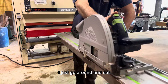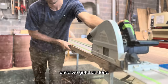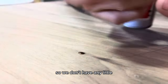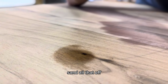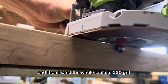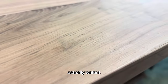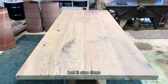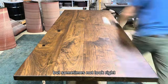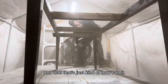Then I just go around and cut square edges onto every side of the table and get it to its final size. Once we get that done, we do a bunch of sanding, start filling all the little holes that I didn't get with CA glue so we don't have any little specks in the table. Then we just random orbit sand all that off. We sand up to 120, then get the eighth-inch roundover and start breaking all the edges, making it nice and smooth to the touch. Then I sand the whole table to 220 grit and move on to a probably controversial step, which is staining this walnut actually walnut. It really deepens and darkens the color, but it also fixes some of those sapwood issues and any incongruent coloring.